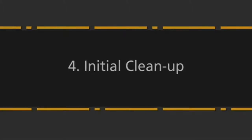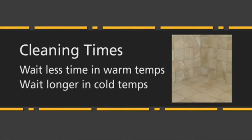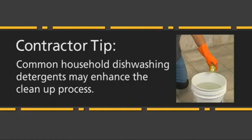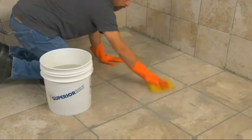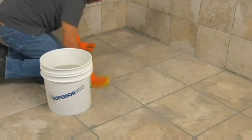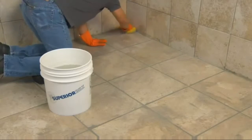About 30 minutes after the grout has been applied in warmer temperatures — wait longer in colder temperatures — do not allow grout to set on the face of the tile. First, add a few drops of dishwashing liquid to the cleanup water. Next, apply liberal amounts of water to the grouted area. Using a grout sponge with as little pressure as possible, work in a circular motion across the tiles to loosen epoxy film and to finish the joints smoothly.